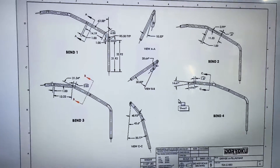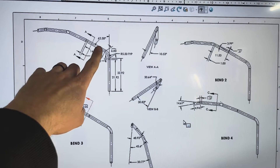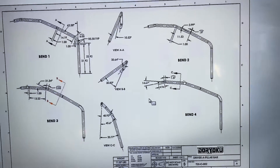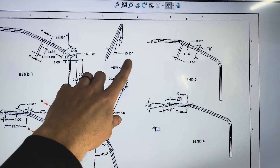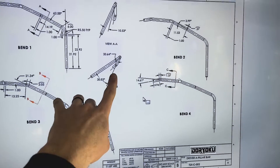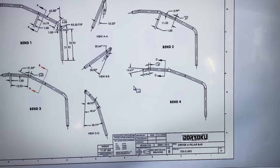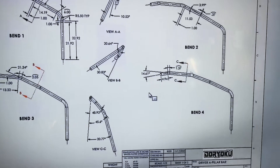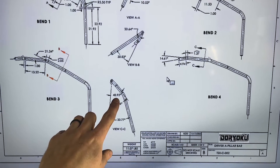The drawing shows four bends. Bend one starts at a 62.5-degree angle, beginning 21.92 inches off the end — giving that one-inch offset to compensate for the die. Bend two is 14 inches off the first bend, with a 10-degree twist between bends one and two. Bend three is 21 degrees with a 20.64-degree twist between bends two and three. The last bend is about 14.5 degrees with a 48.92-degree twist off of bend three — that last bend just kicks it over toward the main hoop.